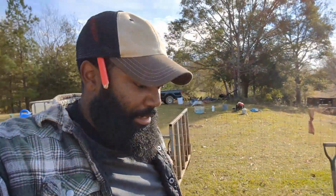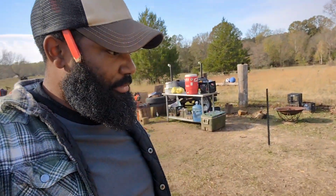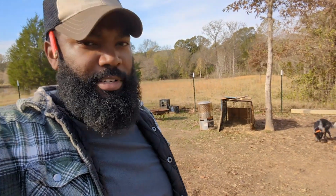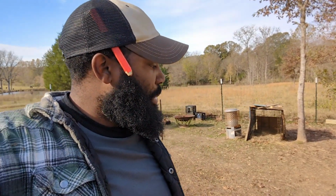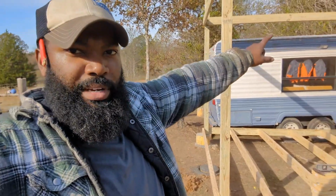We were kind of talking about it last night, and I'm gonna turn y'all around and show y'all what we got done yesterday. Just walk you through and catch you up, because I'm really playing the waiting game. We set these piers here that we poured yesterday, and the concrete is still not cured yet. I probably need to give it a couple more days to cure completely, but I'm gonna see how it feels after a couple hours of sunshine, because by the time I got through pouring these piers, it was nighttime last night, and it was like 29, 30 degrees, so they didn't get time to cure yet. So hopefully the sun will come and dry them up real fast and go ahead and cure them. But I'm gonna try my best not to rush them, because those are gonna be the foundational piers for that second story, and also to stabilize this first story.